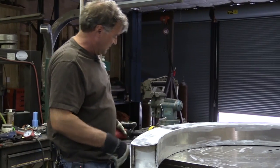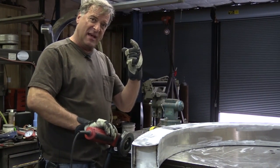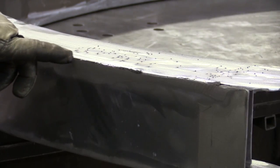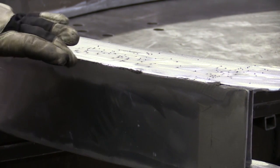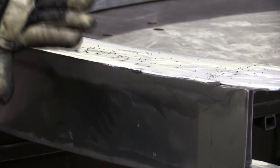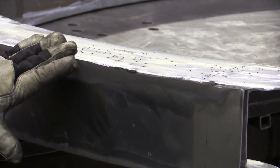As I was grinding on this side, the pad is coming off the metal. And as I'm grinding up here, the pad is coming off the metal. So what I was trying to get was just a sharp edge right here. By grinding up this way and off that way, this should have come out to a nice sharp edge. Then I could just come back with the grinder and hit it one time just to break that edge off.